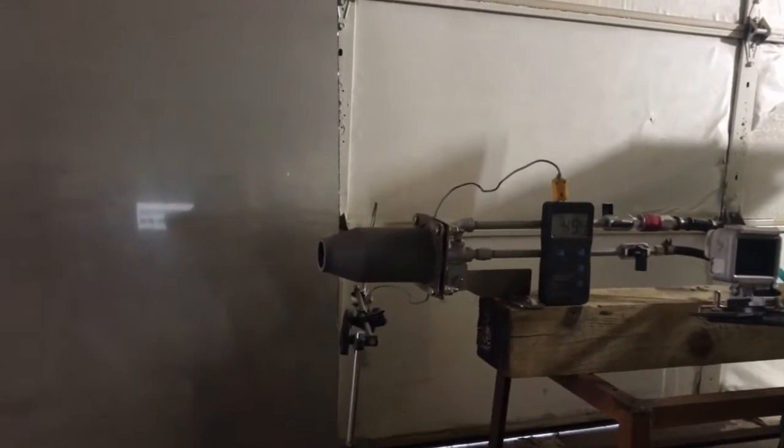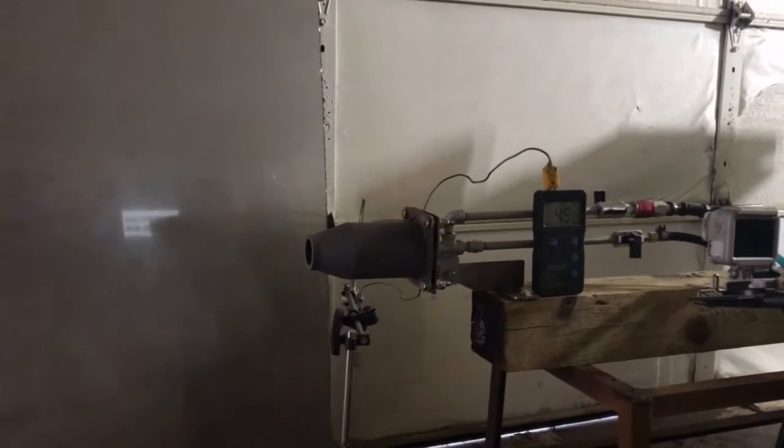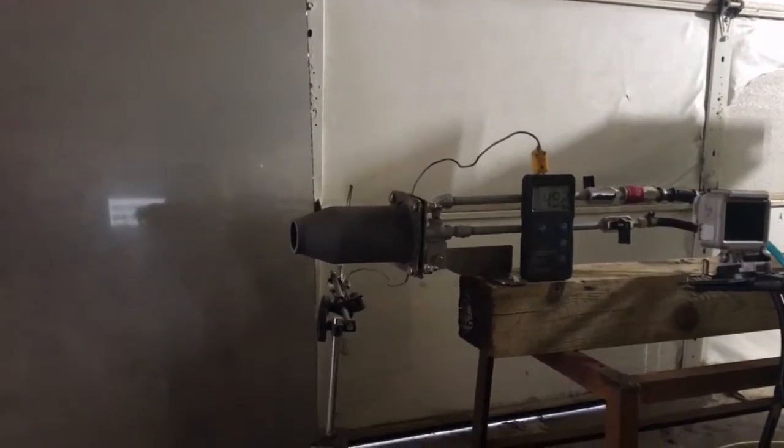The temperatures you get inside a foundry with a burner like this — you're looking at 2700 degrees easy. I say that because I've actually melted some cast iron and some silica sand. To clarify: I understand a regular propane spud burner can get your forge or foundry up to cast iron melting temperatures, which is around 2600 degrees. But if you take that burner out of your foundry and hold it up to a thermocouple, you will not get past 1950 degrees. I have several videos where I do this test with different propane torches, even a turbo torch — one of the hottest propane torches you can get — and not one of them got over 2000 degrees.